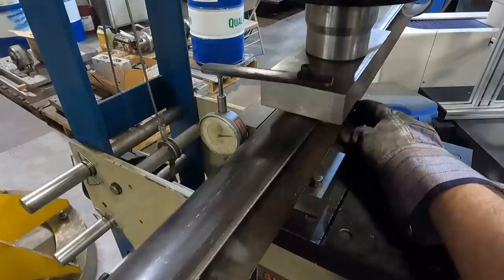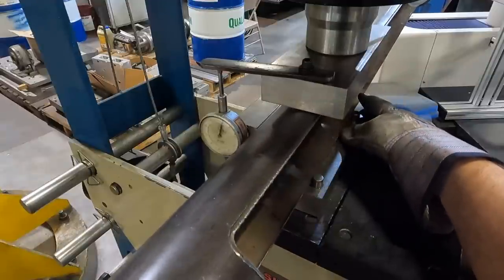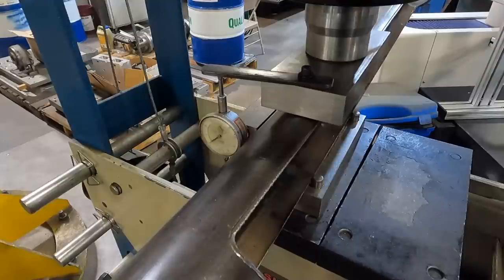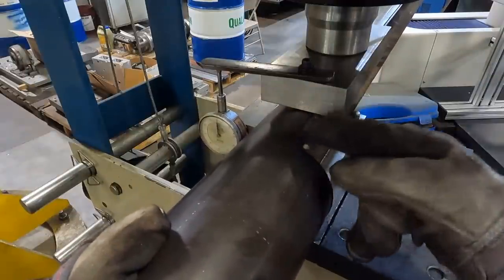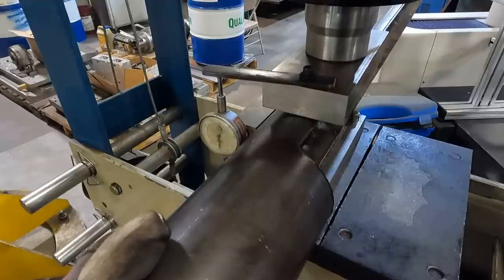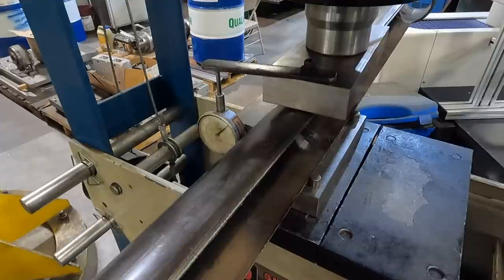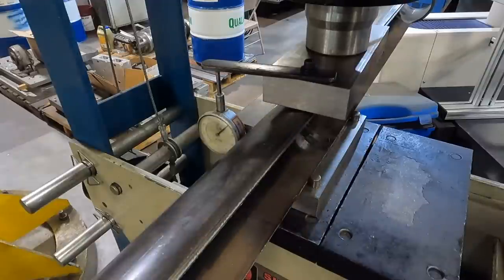You can see how much it takes. You can see why that would be hard to do with the vise. To get closer to the end here, I'm not going to go quite as much because it'll tend to bend right there. Let's see what we did now, just on that end of the part. That's getting closer. About another 25 or 30 thousandths to go.